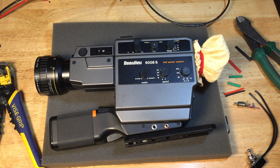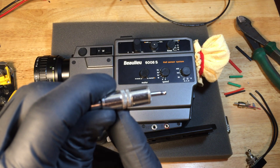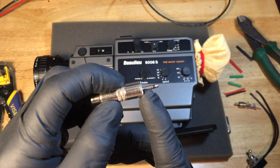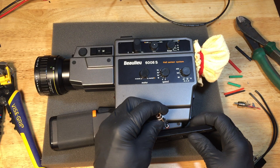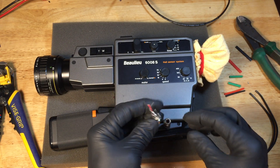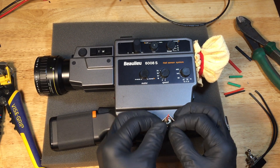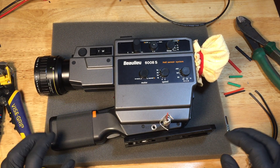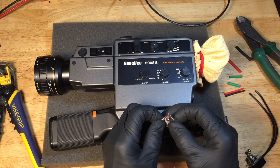I rooted around and found a 1/8 inch mini jack adapter — you'd want it to be two conductor, which I was lucky enough to find. It's an adapter that goes to RCA but has a two-conductor mini jack with a sleeve and a tip. That goes firmly right in there. I also found an RCA connector, bared the ends, and to test whether it would trigger the camera, I put them together. I took the ground, set the camera into motion lock, and if I run the ground wire directly across the hot, it should trigger the camera.